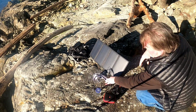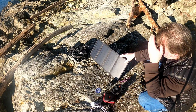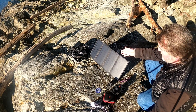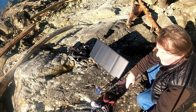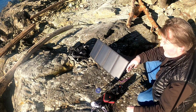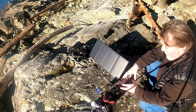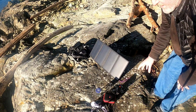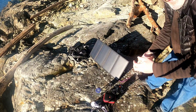But normally, even on cloudy days, even if the weather is kind of crappy, I find these solar panels will still produce, obviously not as much as in full sun, but it'll help offset, so this thing won't be drawn down to absolute dead if there were 3 days of poor weather. I just use that to give you an idea: ideally you want the size of the battery to give you about a 3 days supply of power without needing to charge it, based on the loads that you're doing.